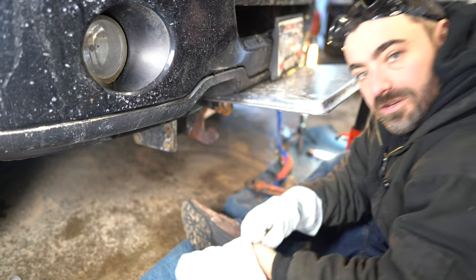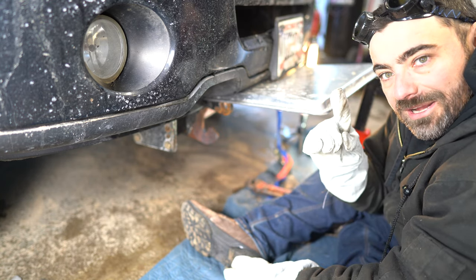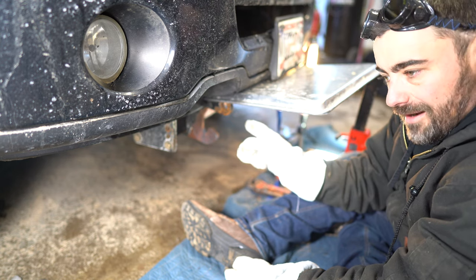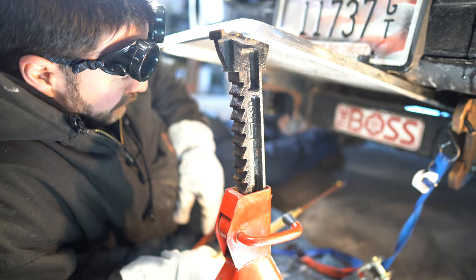Watching all these YouTube videos, I was told these glasses, you could see when it gets cherry red, and Jen was like, it looks pretty red, and it didn't look red at all on my glasses, so I took the glasses off and took a peek and it was ready to go. So I may have been able to bend that maybe 30 seconds earlier than what I did before, but I got a good heat shield here, so I'm not gonna melt all my plastic.